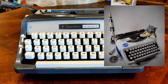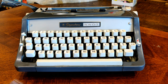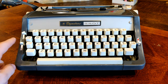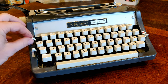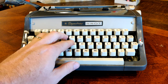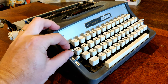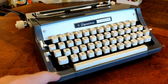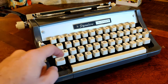Let's go over some of the features of the 440T. We have our standard ribbon color selector switch, and we have a lever here with H and L — that is the high-touch and the low-touch, or high-tension and low-tension. It's a spring tension selector which impacts how much stiffness you feel on the keys. Unlike many Smith Coronas which have these but don't seem to make any difference, on the Brothers they really do — the spring here has a lot of tension and makes you feel like you're doing something when you change it.